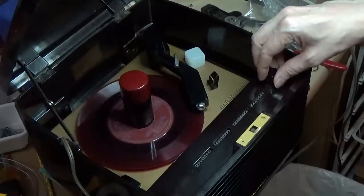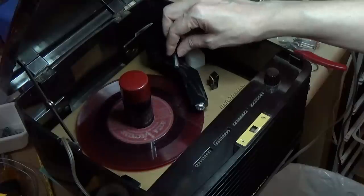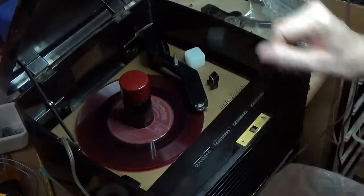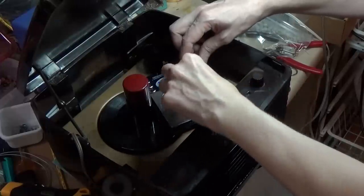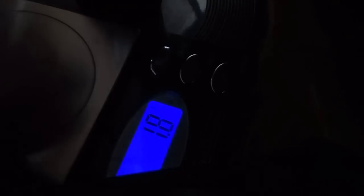I'm going to add a little bit more weight by putting a little screw head up the tonearm, and I just get it to a point where I get the minimum added weight where it will play reliably. Just trying to get the balance. That's 6.4 grams, so it's a little bit over — around 6 grams is really what I want to shoot for. So I'm taking the weights off. I want to measure the weight of the tonearm as it is. It comes up as 1.8 grams, so I'm going to have to add at least 4 grams of weight to get it to track properly.